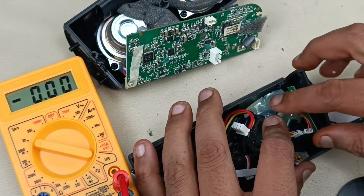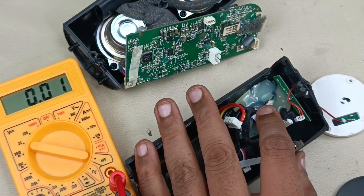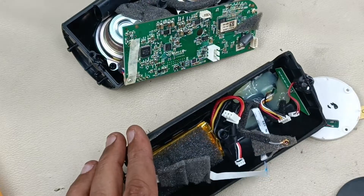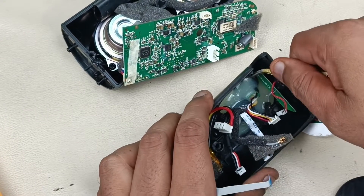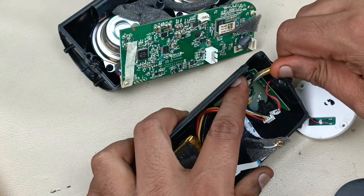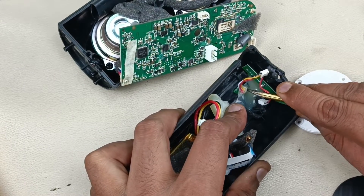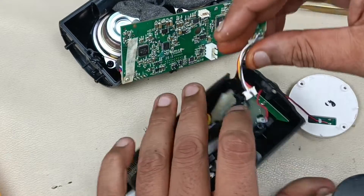Now let us take this board to fix the pin. To take out this pin we have to give some heat over here using a hair dryer or any heat blower. I am going to apply heat here. Now the bonding will be weak after applying the heat. You can see it is coming out — like this it will come out. Without heat this will not come out as cleanly. Now I am slightly pushing the board forward — it will come out like this. Now I have access to this board.